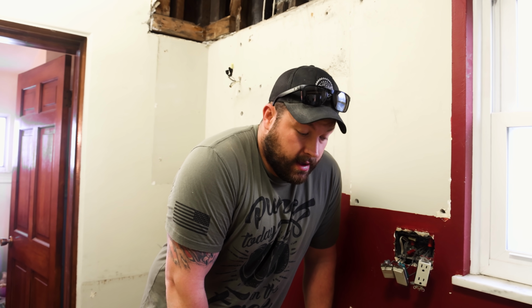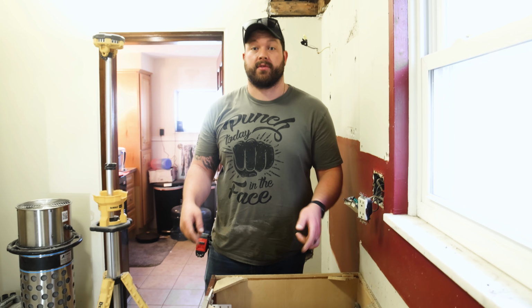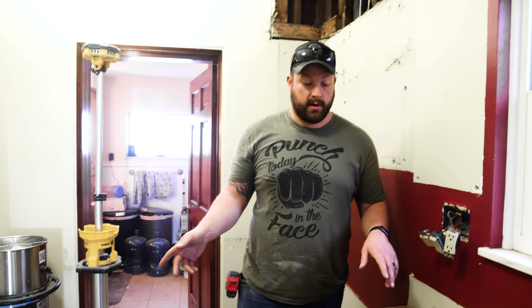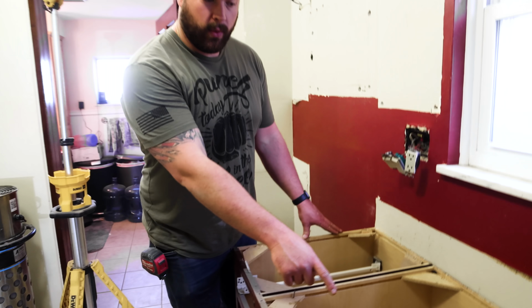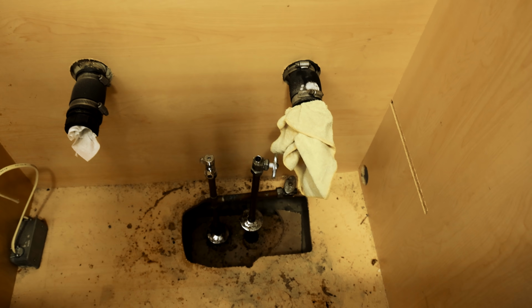So our water lines come out of the floor because for whatever reason, and you can tell they plumbed inside the cabinet after the water lines were pulled through, because we have this horizontal piece that goes to the water line that feeds the dishwasher. It's not the wrong way to do it or anything, it just makes removal a little bit of a pain. We can pull the cabinet off, we just cut a hole in the bottom of it, we'll pop it up, and then we'll clean everything up there.